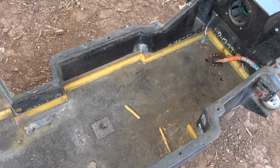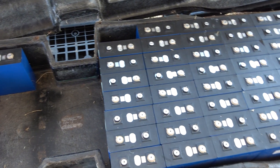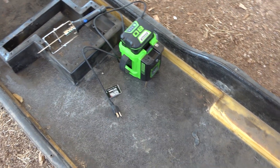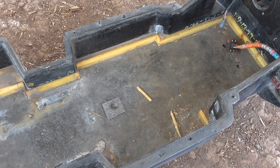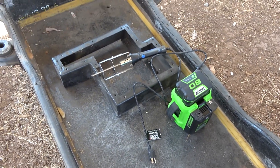Here I wanted to talk about this — this is actually the NIMH battery pack. The one I loaded up here just for fitment and testing is the lead acid battery, but there were two different versions of the battery: the lead acid and then the NIMH. The lead acid actually double-stacked the cells, whereas with this NIMH one, all 25 of the NIMH cells fit in this pack at the base level — there were no double-stacked cells.